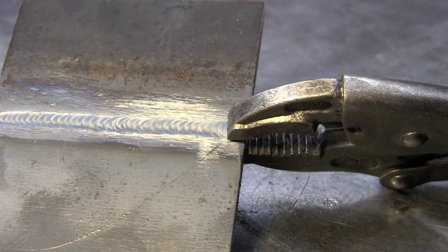Here again I'm using this just as a training aid, but I wouldn't hesitate for a minute to go use this on welding up one of my chromoly cars. It allows a little of the heat to be taken out of the tubing — less heat-affected zone, less crystallization, stronger weld.